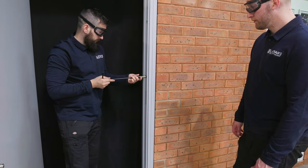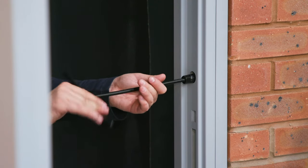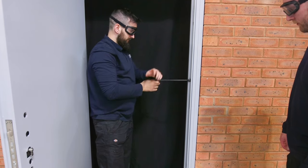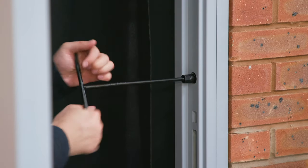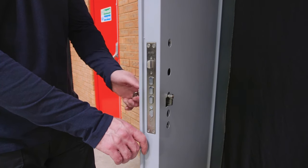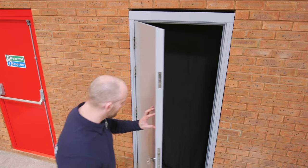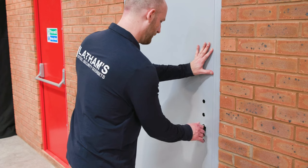If you aren't using the wind out lugs in your installation, you can use fitting shims. Install the latching side of the frame to suit the way the door leaf is sitting — this will prevent spacing and latching issues. While the door is open, test the locking system by turning the key in two complete rotations. Close the door into the frame and repeat. If the door locks and unlocks smoothly, the door is fitted correctly.